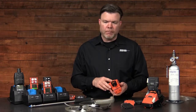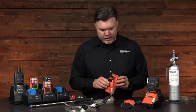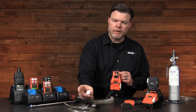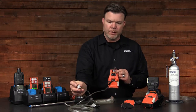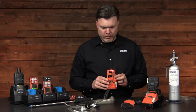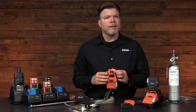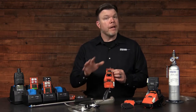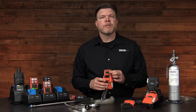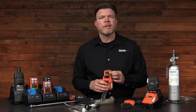After the pump has been operating for a couple of seconds, we're going to conduct a pump fault test. I'm going to cover the audible alarm because it's going to be quite loud, and I'm going to block the input of my sampling tube. By going into alarm, it ensures that the sampling path I have is tight and that nothing will actually prevent that from blocking. That's so that I know when the pump goes into a blocked condition if something happens to be pulled into the sampling path and I can't see the end of my tubing.